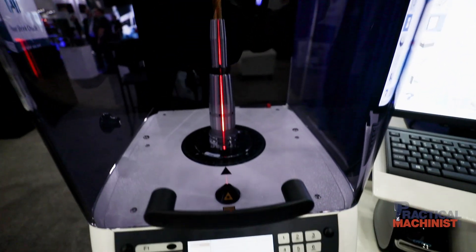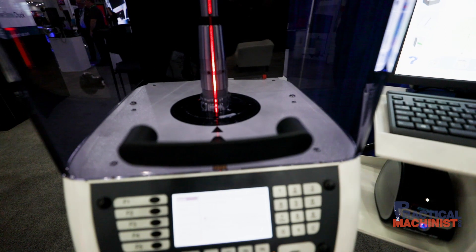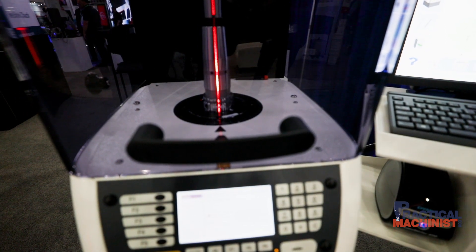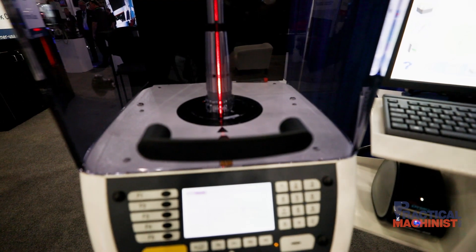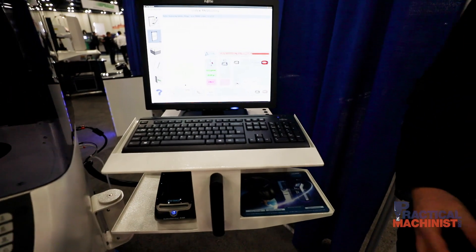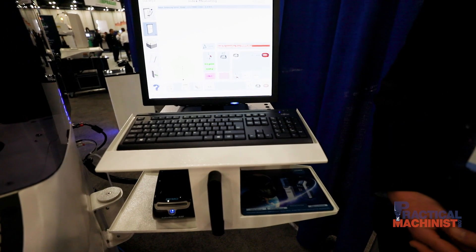So you see it spins. It identifies where the tool is still a little bit heavy, but as you can see, the actual holder assembly is balanced. We just displaced weight via balancing rings to bring the tool into balance. If you scan over here, you will see that the results show us that we are balanced to 20,000 RPM. The green is good — we truly are balanced.